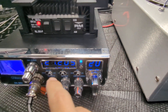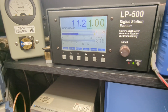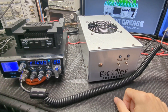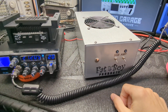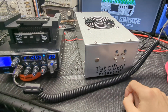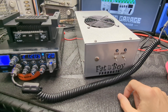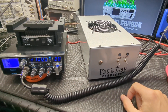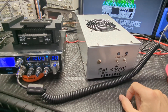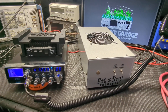The drive varies with the voice — 120 to 140 watts — because I don't have the power turned up all the way. If I turn this off you can see we're hardly putting any radio drive into it. So there you go — that's it for this one. It's working good, 700 plus watts from a four-pill. These C boxes all do right about the same. They really wake up after about 100 watts peak drive — below that you're just loafing it, you'll see about 500 or so. Alright guys, Radio Garage, we're off the key.